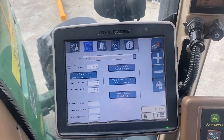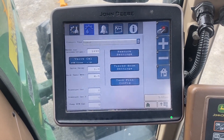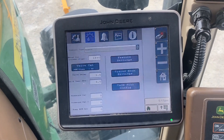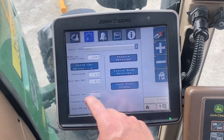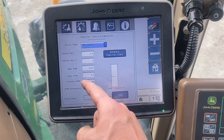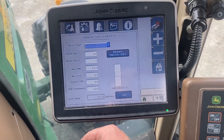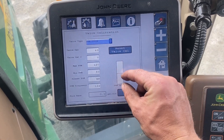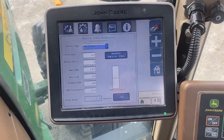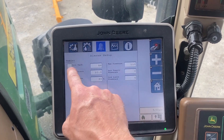There are a bunch of settings under the settings tab. My meter cal for the flow meter is 1450 pulses per 10 gallons. I'm running a PWM valve, so here are my numbers: 43 valve cal, max is 120, min is 40, and preset is 68. That's my PWM window, and it's dialed in pretty good. We'll fire it up in a second.